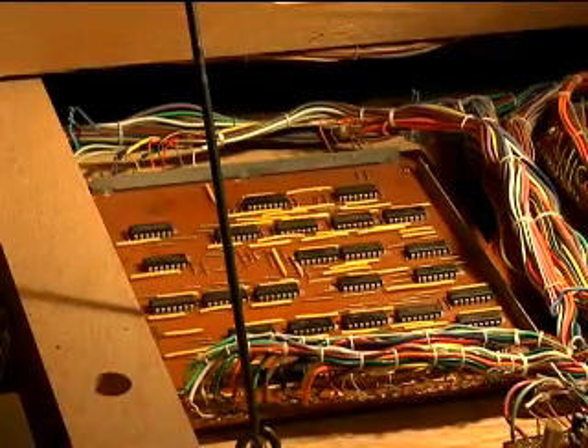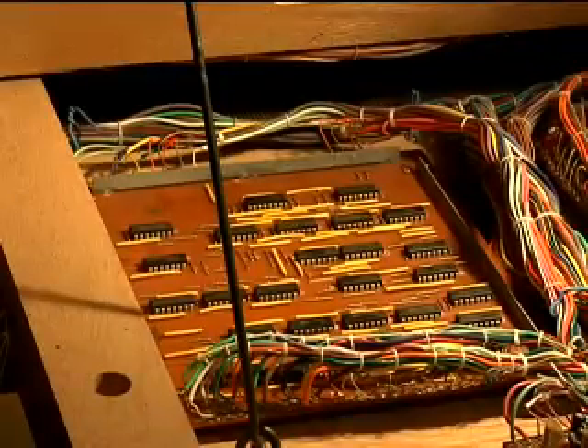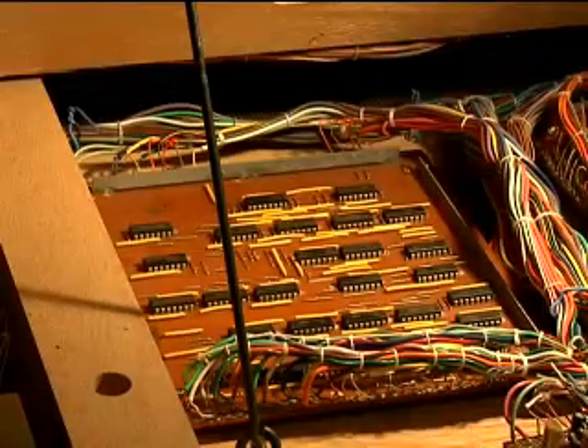This gives you a chip with a lifespan of approximately 15 years. Seeing as these keyboards are about 25 to 30 years old, these chips need to go. And somewhere on this board is a shorted out device.